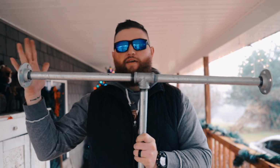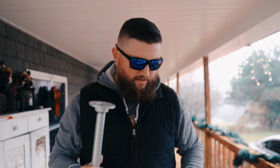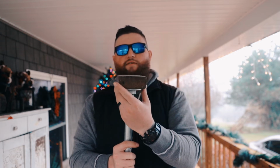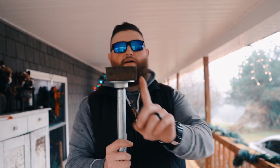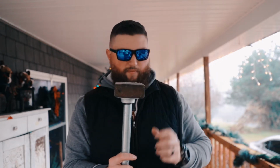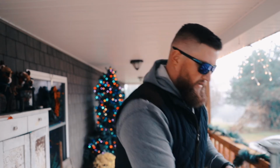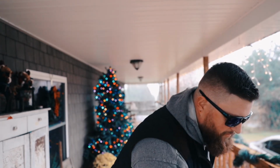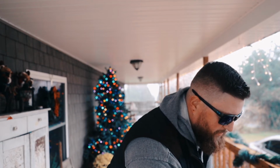This is my idea. So we've got a base, a top plate for the top. Like I said, I'm actually going to mount this 4-inch piece of 2x4. I'll drill some holes and mount that there. Then I'll have one hole with a 1/4-20 screw coming up through to mount my camera up on top of that. That way it's not like the camera's sitting on that bare wood. Plus it gives me something to grasp my bolts and stuff too.